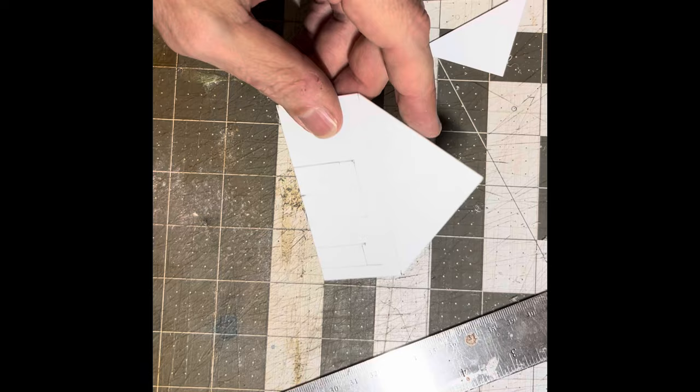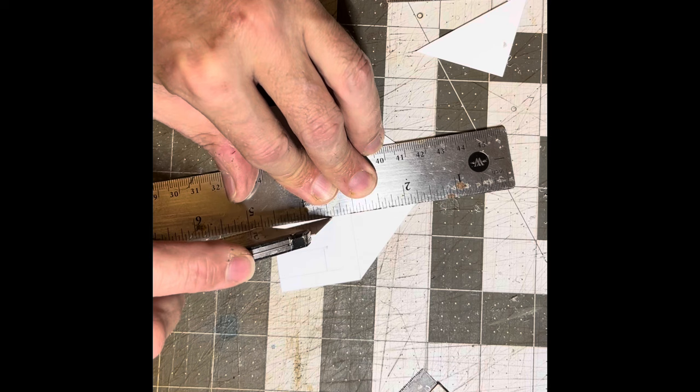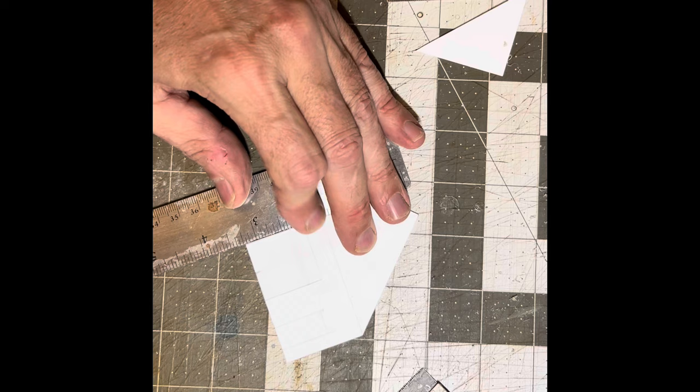Here I'm cutting the sheet for the front of the barn. I don't cut all the way through anything bigger than 20 thou — I'll score it and snap it. Usually the first pass I make with the razor is just a very light mark, and then I make another pass so the knife has something to follow. The third pass on something intricate like this, I'll push the knife through and then snap it out at the edge.